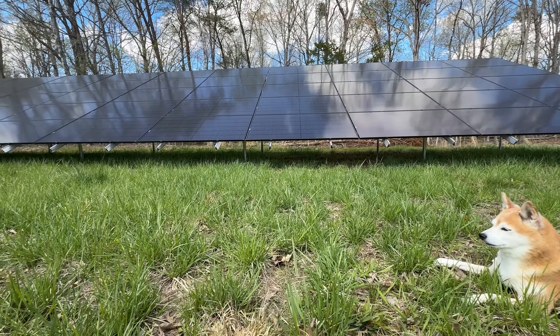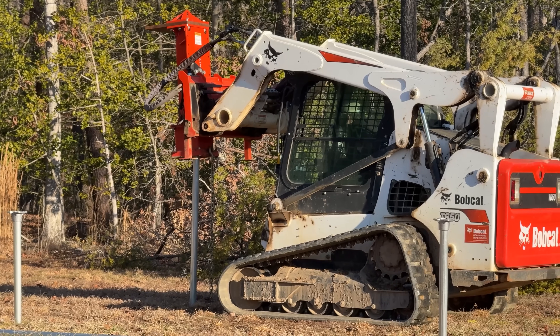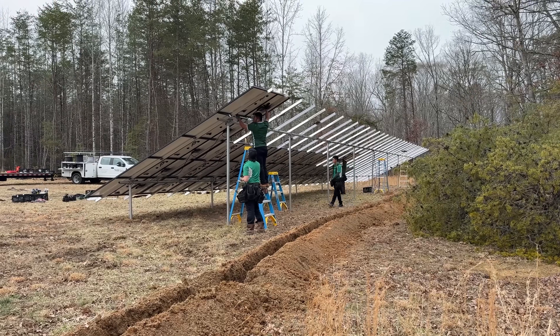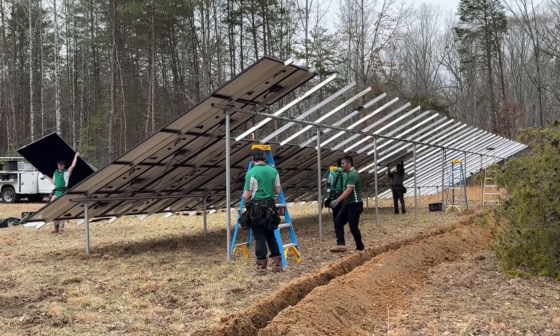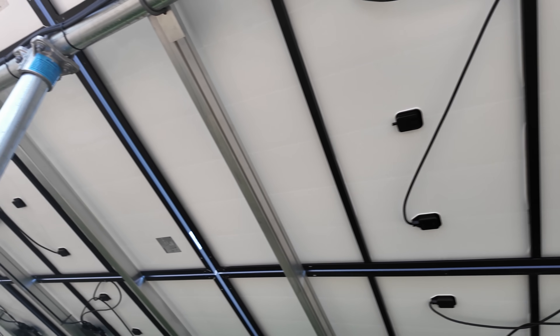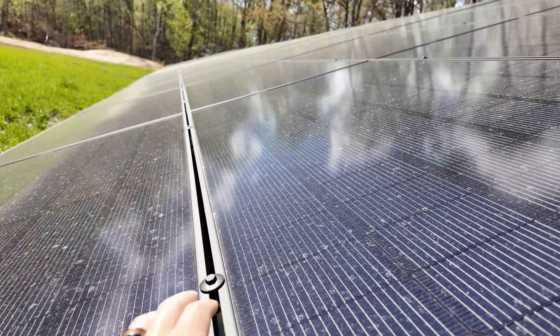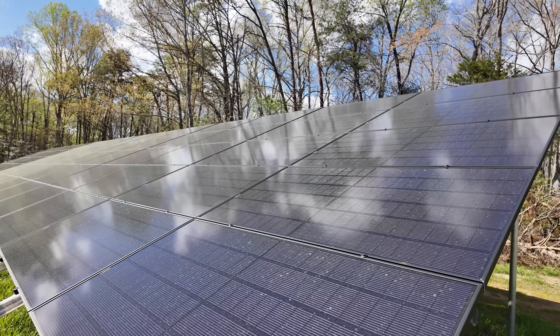I already got the first piece of the array up, but it's always stressful when you have another thing hanging on. My to-do list is a mile long, so this is done, finished, complete — no más. The way this was installed, it's basic equipment racking. They just drove these pillars in, back side and front side, with struts running through. Then they rack the panels, bolt them on, and hold them down with pressure. The microinverters are just bolted on the back side, and all this stuff is nearly pre-wired. When you look at the connection points it's pretty plug and play, with a little zip tie wire management — easy peasy. There are just four bolts on each panel. That's it.